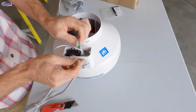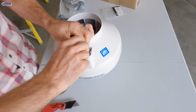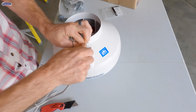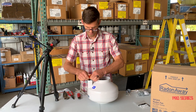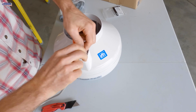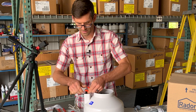Now that we've got that snugged down, we can hook up our wire connections. We're going to go green to green — twist those two wires together and then put on the wire nut. Then we'll go black to black. You're going to want to twist these to the right so that the wire nut, when you thread it on, tightens everything down instead of loosening everything up — righty tighty, lefty loosey.